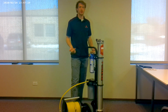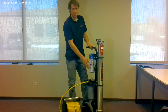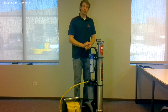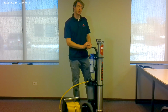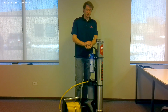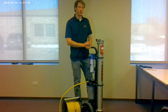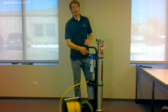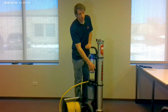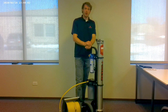We are now ready to start production. You turn on your tap source and water would fill up the pre-filter and start flushing out of the bypass valve. This is meant to warm up your RO and saturate it. Initially, a dry RO is not going to produce the clean water that you would expect it to. So we flush it for 15 minutes before first time operation to make sure that the RO is fully saturated and ready for use when you go to close the bypass valve. After 15 minutes, you are able to close this bypass valve and your cart will start producing water.